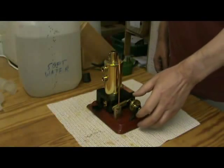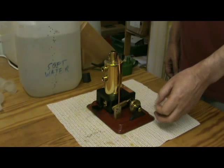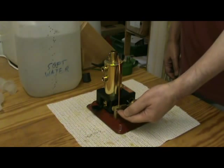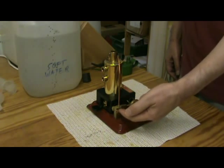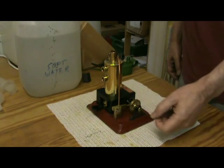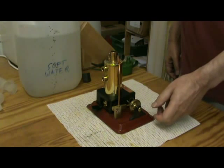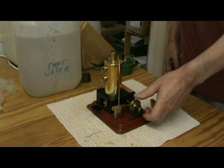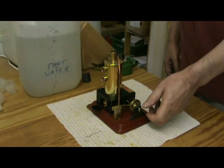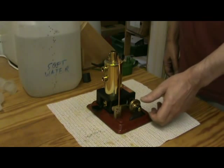One novel aspect of the design of this cylinder here, this oscillating cylinder, is that the trunnion bolt is behind the two ports, or below, depending on how you look at the piston. I'm not so sure that's a good idea. But it seems to work. It's probably cheaper to make that way.